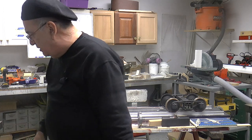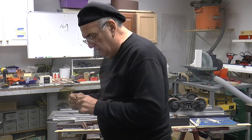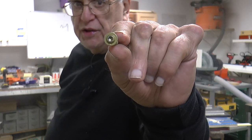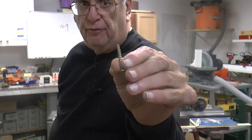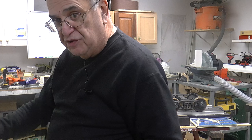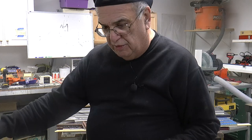Screws — we can do the screws thing. Here's the screw I use: I like Torx head, drill point — it's got a drill point to it. And you say, well what do you need that for? Well going through this stuff you don't have to drill it. Imagine drilling — I've got 80,000 ties. Four times 80,000 — you're going to drill 250,000 holes.